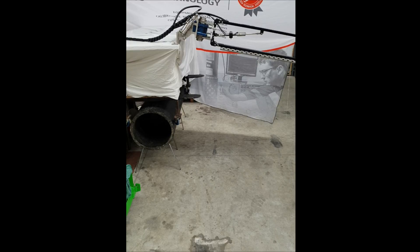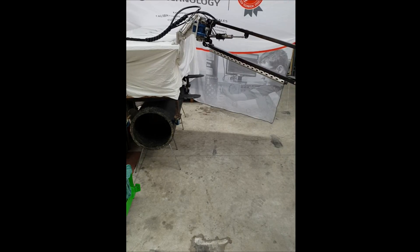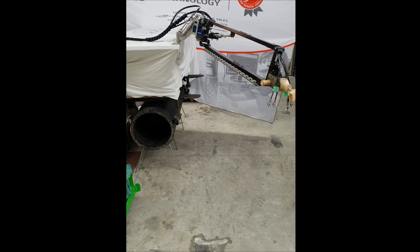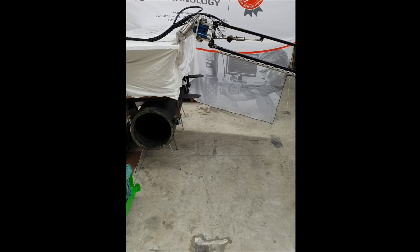One of the main benefits of this tool is its hydraulic breakaway. You can see here I'm simulating smashing into them. So you're tearing along with the ROV and you've hit a rock, a jacket, or whatever. Now instead of smashing up the shoulder, bending the cylinders, and basically tearing up the arm, what this will do is give an adjustable amount of give. So instead of the arms getting destroyed and having to recover to deck and repair the arms, you simply reset them from wherever they've been smashed around to a new position.